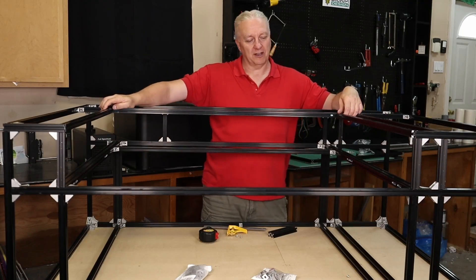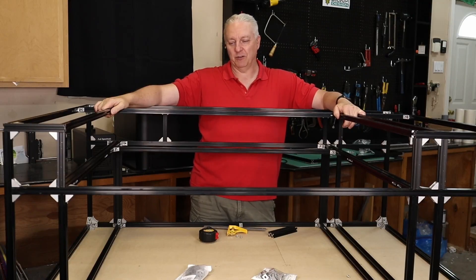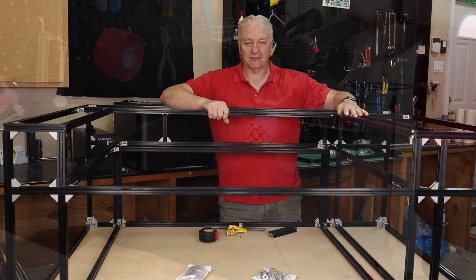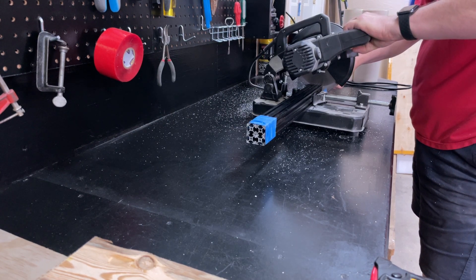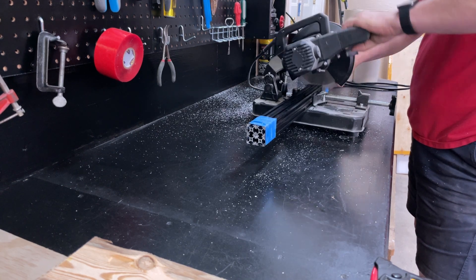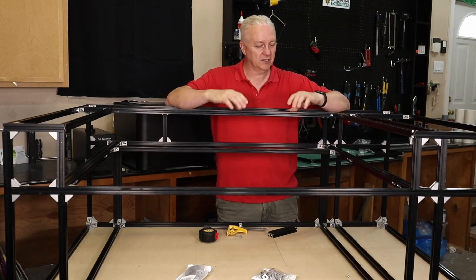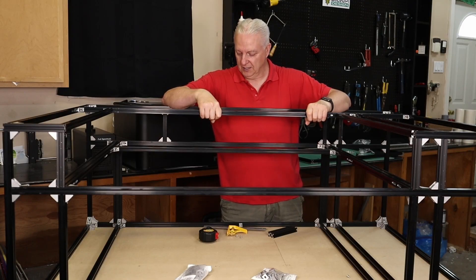If you wanted to build one of these, I'm thinking I'll take a whole bunch of photos and put them in a collection so that if you're interested you could see how I assembled all of this. It's really not that hard. By far probably the hardest thing in this project is going to be cutting the metal. I actually have a saw specifically for cutting extrusion or any metal. If you're lucky, you have a shop nearby where you can not only buy this but get it cut to the right lengths. The long pieces are mostly 1500 millimeter edges and mostly 2020 aluminum extrusion.